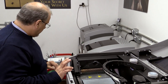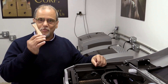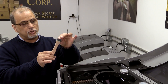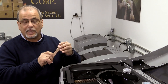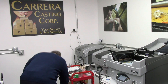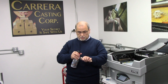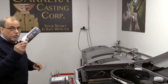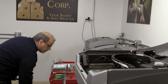My method of cleaning is to use the brush, which is provided when you buy your Solidscape machine. Make sure it has nice long bristles and is basically clean. If not, you can use a can of air, or if you're in the jewelry industry, use your steam machine to get all the dust off. That's the only time you use this — do not spray anything onto the machine.